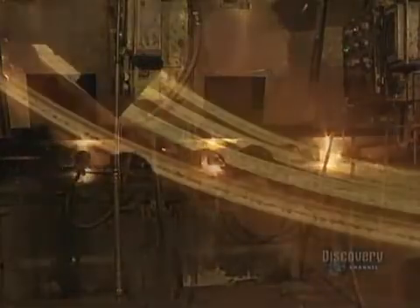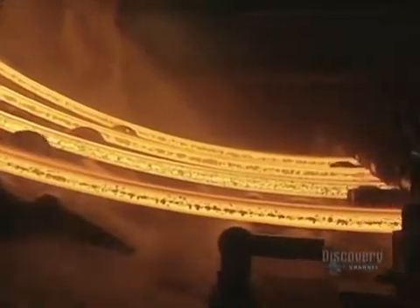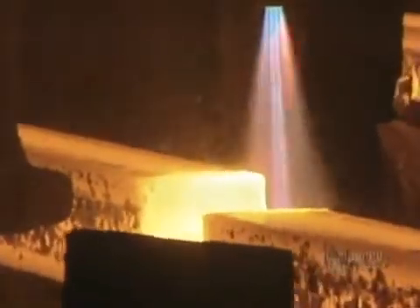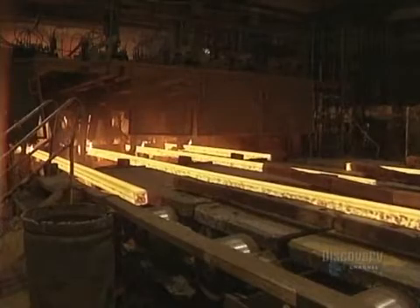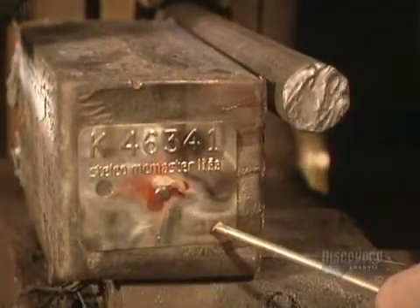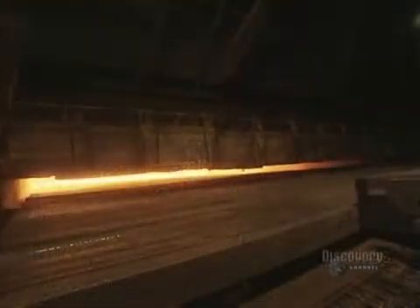A workman now opens the pouring nozzles of the distributor, equipped with four pouring holes. The molten steel runs into molds. It very quickly cools and begins to harden. Steel billets are produced in lengths varying between 4.5 meters and 10.6 meters. The billets are then cut to the desired length with a natural gas torch. A pouring identification number is marked on them with a wax crayon. The difference between a steel billet and the nearly finished flattened product is clear.